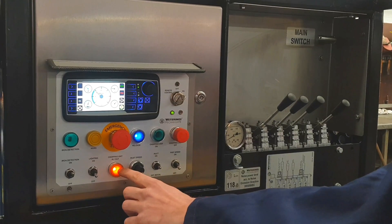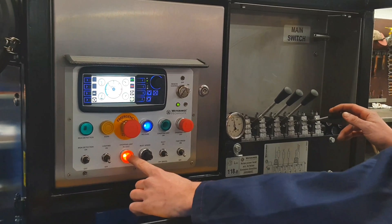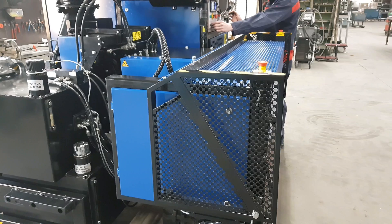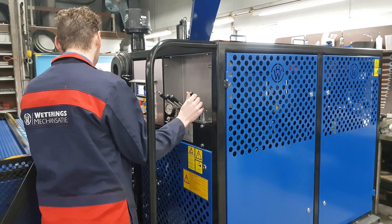Step 8: Press and hold the orange IN-OUT button and pull the outer right lever towards you to open the chopping unit. When the button is released, the engine will stop. To restart the engine, press and hold the orange button and press the START button.